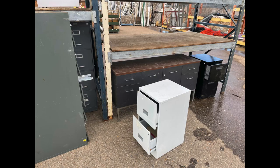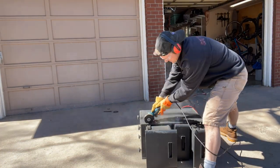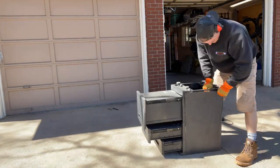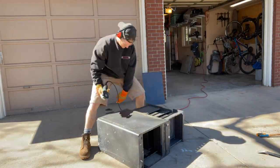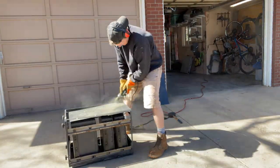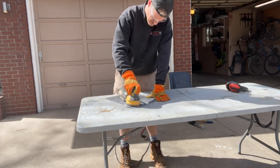This project started with a trip to the architectural salvage yard where I found myself a filing cabinet for about five bucks. In general comparison to the other filing cabinets around, I found the heaviest one I could find to feel like it was the heavier gauge steel. I then took my four-inch angle grinder and cut it up as best I could, getting good pieces to work with from the sides and also the bottom of the drawers. Then a little quality time with the orbital sander to get it sanded down to bare metal.